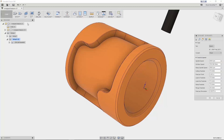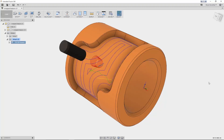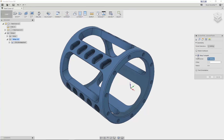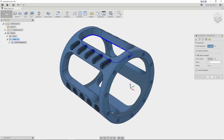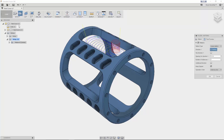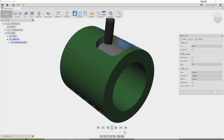Now let's talk about the new four-axis simultaneous toolpaths. This toolpath will be essential for machines with a rotary axis. We now have a wrap option in the 2D adaptive clearing, 2D pocket, and 2D contour toolpaths in order to wrap around cylindrical objects. Once enabled, select the outside diameter — the radius is automatically populated. Just as with any other 2D adaptive toolpath, you can select the edge to determine the distance to be roughed out. Fusion 360 will unwrap the selected boundary, apply the toolpath, then rewrap it correctly on the cylinder. Using a circular pattern, we can ensure this wrap roughing strategy cuts all five pockets.